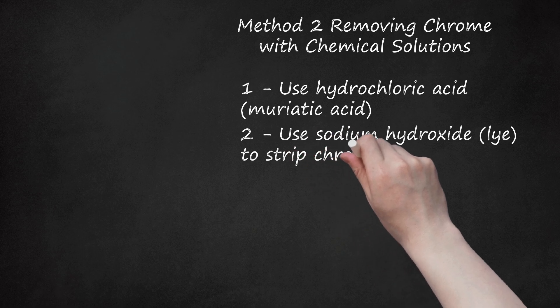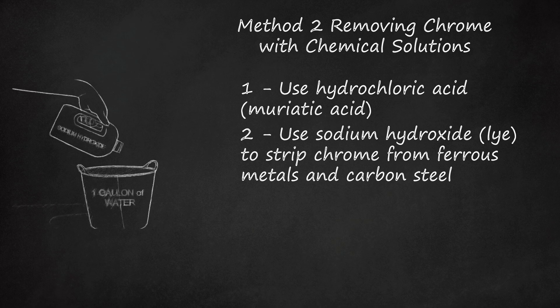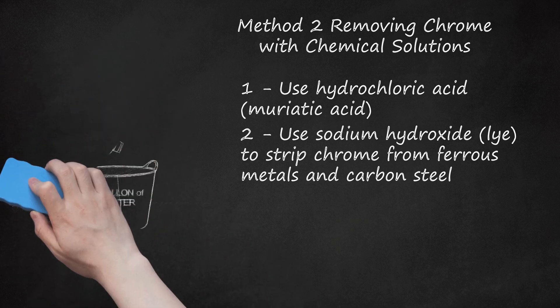Step 2: Use Sodium Hydroxide (Lye) to strip chrome from ferrous metals and carbon steel. Sodium hydroxide, commonly called lye, is a caustic, highly basic chemical. It can dissolve several types of metal plating, including chrome, but reacts dangerously with water and aluminum, corroding the aluminum itself and producing flammable hydrogen gas. Thus, it should only be used on items that do not use aluminum as a base material. Mix 8–12 fl oz (about 227–355 mL) of sodium hydroxide with 1 gallon (3.785 L) of water in a vat made of neutral material, like a heavy-duty plastic bucket. Soak the chrome-plated object in solution until chrome comes off. This may take a fairly long time, so frequently check on your item's progress. Wash the object thoroughly in soap and water, and rinse before drying.